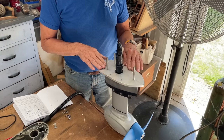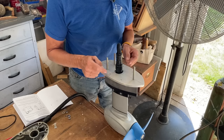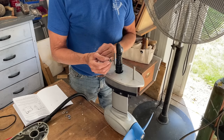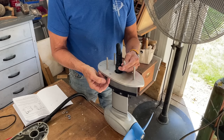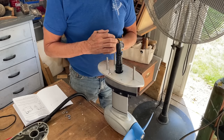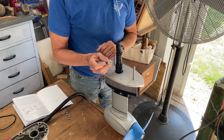So my plate fits on there really nicely. Now one of the issues, and I was afraid that this might happen, are these holes here, that the side of the pod just comes right up to the edge of that hole. So what I'm going to do is take some flathead stainless screws and countersink in there so that screw will be up in there before I put the case on, so I'll be able to tighten that down. And they're tightened with an Allen wrench.